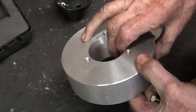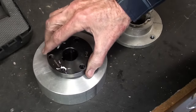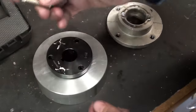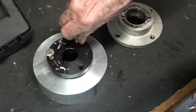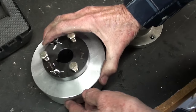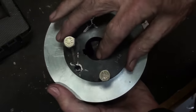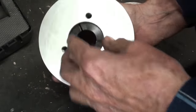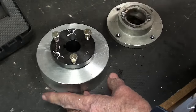There's about a half inch of thread in there and it's just clearance on the back side. And these are grade five hardened bolts. Let's see if they line up — and they do. That will tighten down against the shaft. I don't know if he's got a keyway in the shaft or not. But it's looking pretty good and I think I'm done.